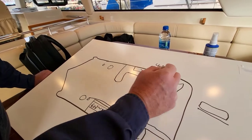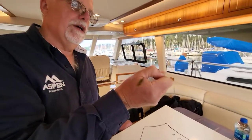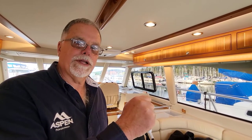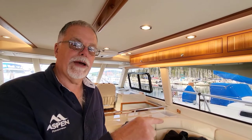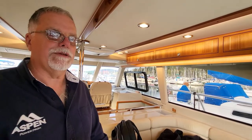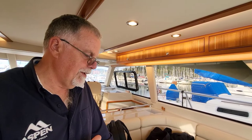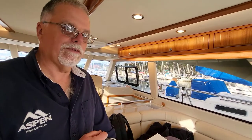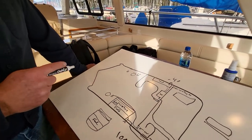We have switching back here in the engine room behind the engine. There's a rotary Y-valve with a big label explaining how to use it — you have to rotate the Y-valve and then open a shut-off to let pressurized fresh water run into the toilets. The last thing you want is salt water coming back into your fresh water system, because drinking salt water will cause severe gastrointestinal issues. When cruising, switch to salt water and when you get back to the dock, run fresh water through or use the shower wand to flush fresh water into the toilet so it doesn't smell.